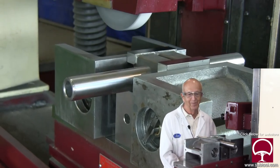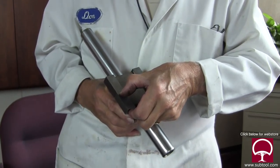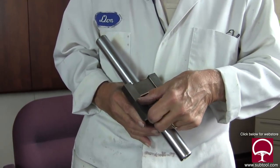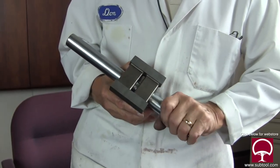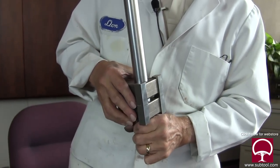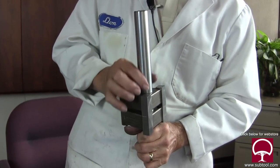That's it folks, we are done — take a good look at that. We just came back from the shop, did our surface grinding, and I'm really happy with the way it came out. The finish is beautiful. You can feel within a couple of tenths when you've got sharp edges like that — it's a beautiful part, it came out great. This bench center will be used horizontally or vertically, so this surface has to be ground square and parallel with the centerline of the shaft. We've completed that and I'm happy with the result. Tell your friends about us on Facebook, Twitter, Instagram — please subscribe if you like what you see, and thanks for watching.